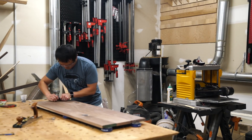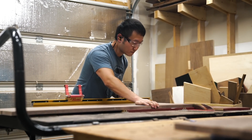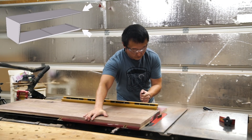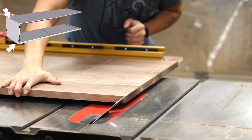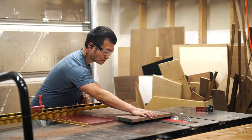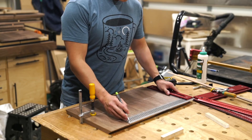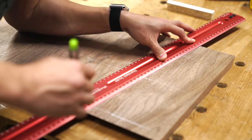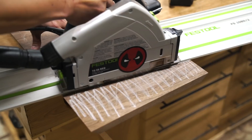The next day, I removed the panels from the clamps and used a scraper to clean up the glue squeeze out from the seams, and then I was ready to cut the panels to size. Both the top and bottom panels will receive a vertical cut on one end and a 45-degree miter on the other, while the left panel will receive miter cuts on both ends. To finalize the width of the panels, I find it's easiest to cut the taper on the left panel first and then use that to finalize the width of the top and bottom panels.